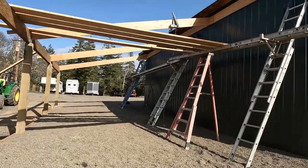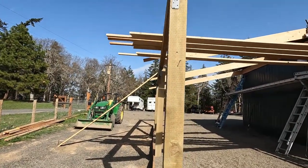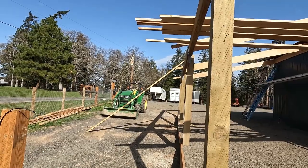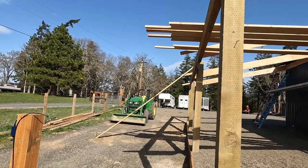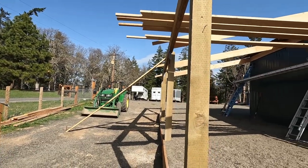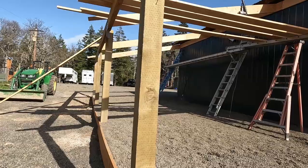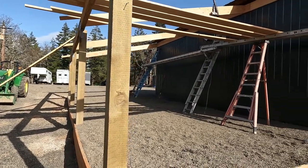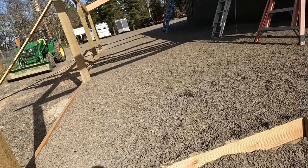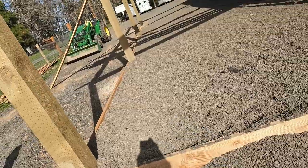That's what it looks like. What I did here is set all my posts so every rafter is on a post. I had to straighten out that one parallam beam and put a brace on it. Now I'm going in and cutting all the rest of the rafters, getting those up, and then I'll do all my framing for the metal. I'm also going to pour a 12 by 18 slab right here to put all my hay on — the rest will be gravel for equipment.